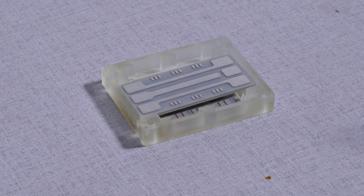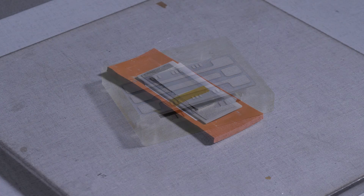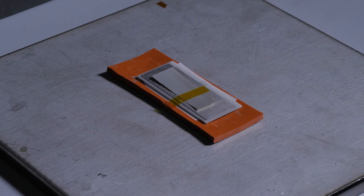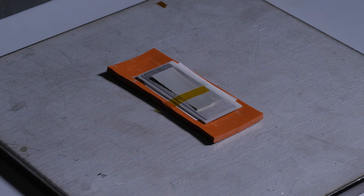To complete the assembly, the entire module is encapsulated in a commercial silicone gel. Here is an example of how to transfer the silver preform onto a substrate while ensuring a uniform pressure distribution. There is a pressure sensitive film in the stack that will show the distribution of force applied by the hot press to ensure that it is uniform. High temperature silicone rubber sheets are cut to size to assist in pressure distribution.